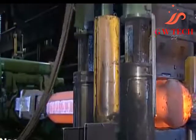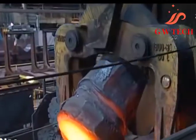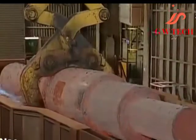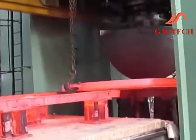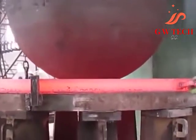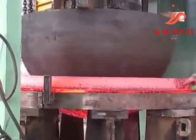These processes prepare the workpieces for further forging processes. Advanced open die forging techniques are capable of producing complex shapes even in large parts and products, in addition to simpler shapes like bars, ingots, and rounds. While steel and related alloys are the most common subjects for open die forging, other metals can be shaped this way as well, including copper, nickel, and titanium alloys.